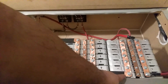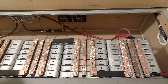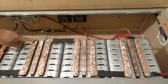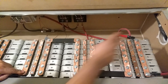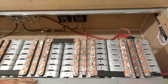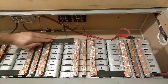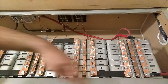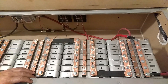7 more in parallel, then I run them in series. What you do is you're going to be using your ground off of one end and the hot off of the other. I like to use this configuration so the current flows through all the batteries, because current runs in a circle. You want it to flow through all the batteries — that helps keep the batteries equalized and everything stay equal.